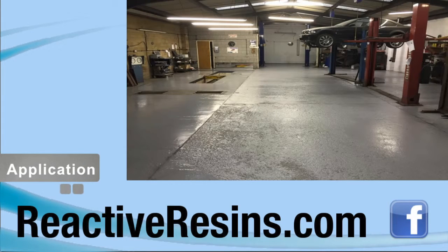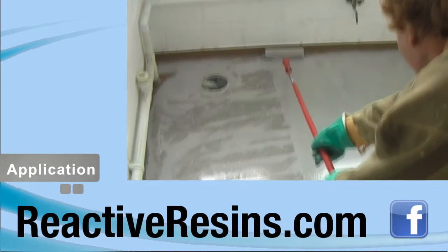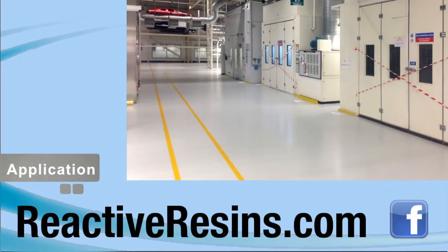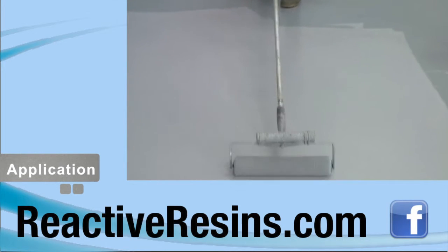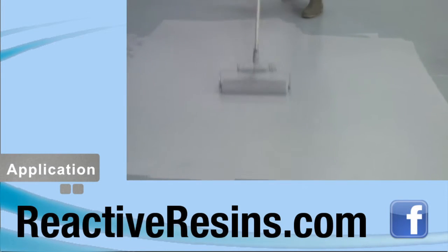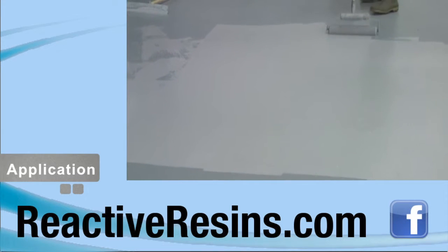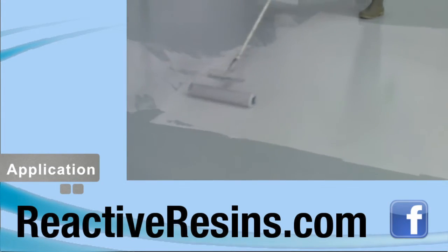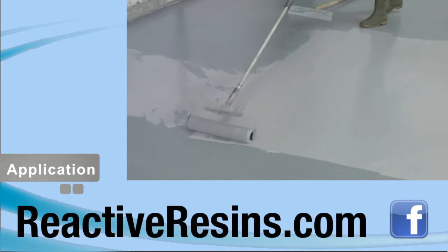Conceal TSF can be applied in high humidity, but cold or damp conditions may cause a slight reduction of gloss in the finished coating. TSF can be applied by any method, but 15-inch medium pile rollers fitted with extension handles produce an excellent finish. Large areas should be divided up into manageable sections. Cut in around the perimeter of the area to be coated with a brush or a 4-inch roller before applying an even coat with a roller, starting in a corner.